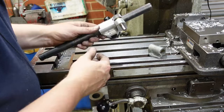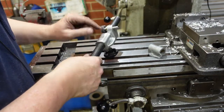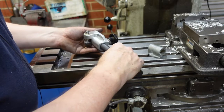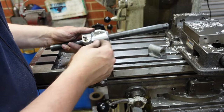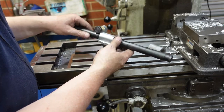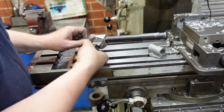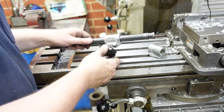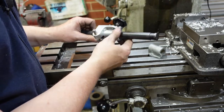So this is the finished article. I've given it a bit of a linishing to try and get the corners down. I did a flat run across there, wasn't too happy. Hanging onto this thing to get these final fillets on was a bit awkward, and as you can see I had a cutter slip there, which is a bit of a nuisance. But other than that, I think it's quite good. So this now adjusts up nicely, locks it - I haven't got the handle here to do the rack and pinion thing, but that'll work. Thanks for watching and please spread the word. I'll see you next time. Bye.